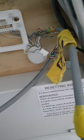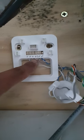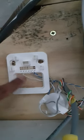These are the CAT6 wires I had lying around. This one here is coming from the transformer, going around and connected to the chime. And this wire is coming from the front — that's my doorbell. From the doorbell I'm just using two wires: the solid blue and the light stripy blue. From my transformer I doubled up on the brown pair and doubled up on the blue pair. The blue pair is my neutral. Here's the live — that's the doubled-up brown pair which is connected to the Nest connector. And here's my front which is A1, connected to the white.